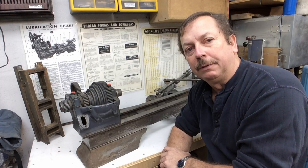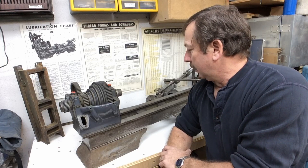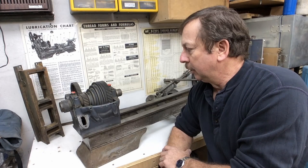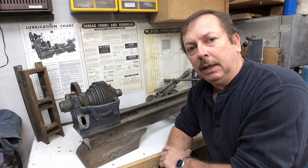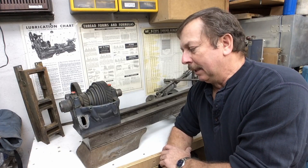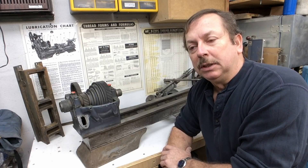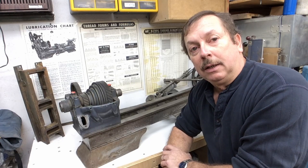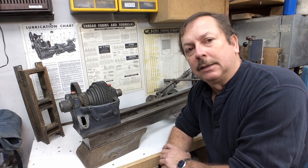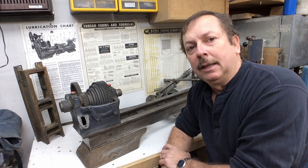They had a little more ribbing in them from the factory. This is just to show what's going on with it. The bed was quite worn when we first got it. We're just going to rebuild it and make it into a production lathe. The bed had quite a twist in it when I set it up. I don't have a surface plate big enough to run this across, so I just did some initial measurements. It had a twist in it. The tailstock end on the front of the way is why it was out 0.005 to 0.006 is my guess. You don't have a surface plate big enough to set it on, so it's tough to get a real accurate measurement, but it kind of acted that way.